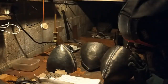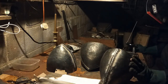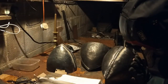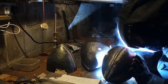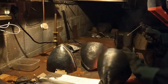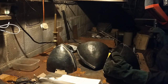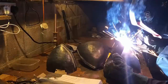Although you don't need to for this type of helmet, I wanted to add a nasal bar, so I cut out a 4cm by 10cm rectangle of 2mm mild steel to weld onto the helmet. I'll be trimming it down to my preferred size later, but it's always good to have too much material rather than too little to allow for mistakes. As you can see here, we have multiple helmets currently being welded because we also sell them to re-enactors and collectors alike through our website, Lancaster Armoury. I'll put a link in the description below if you're interested in the handmade re-enactment safe nasal helmet made in England.